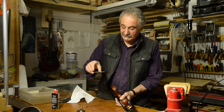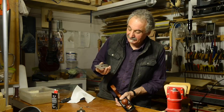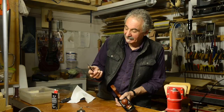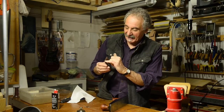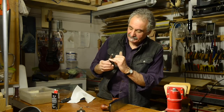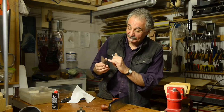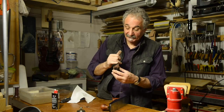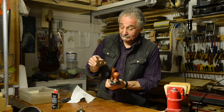In just under a couple of minutes we've honed this blade. We've checked that the back of the blade is flat — that's important, you want a nice flat surface on the back — and we've polished the edge without changing the angle. You can add a secondary bevel if you wish, but I like to just dress up the bevel that already exists. We're honing to the same bevel angle, and as long as you end up with a nice sharp blade, either approach works. This one is now nice and sharp.